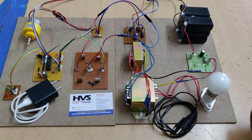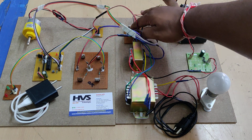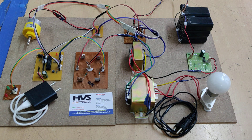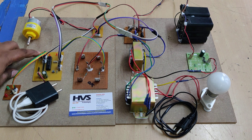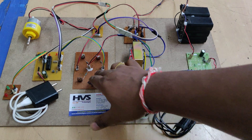We are providing 12V DC input to this bi-directional DC to DC converter. By selecting the switch, the system operates in DC mode or AC mode. In AC mode, the 12V DC is converted into AC directly with the help of this H-bridge circuit.